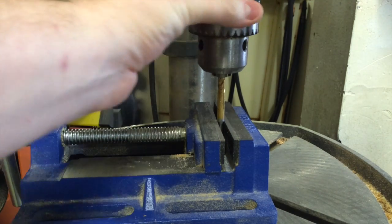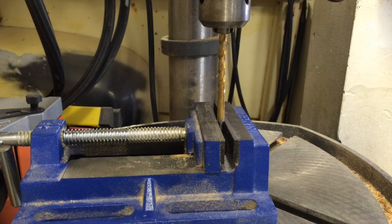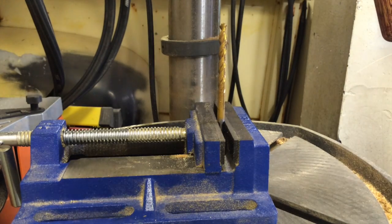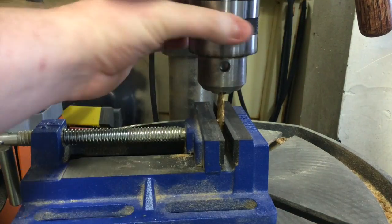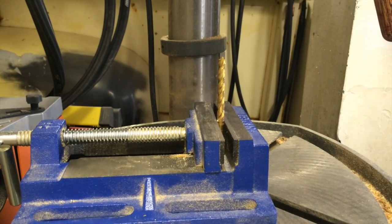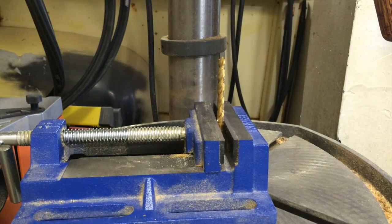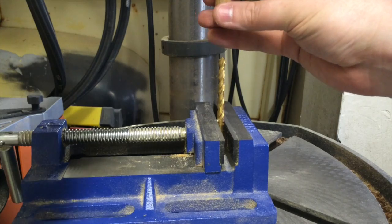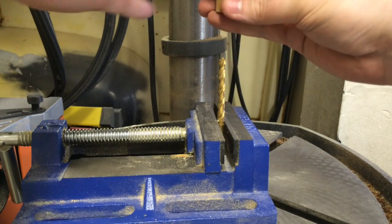The reason you want the chuck to be very loose is so you can just finger-untighten it and pull the material back up. I have this dropped down a lot so you can actually see it — this is still closer than I would normally want, so I'm going to drop it down even further. Then raise the chuck up off of it. At this point it's nice and tight — you can give it a little extra — just make sure you don't move it from here on out. Now open up your chuck really wide. I'm going to go about halfway through and then do the other side as well.